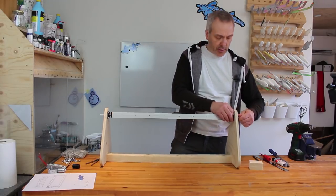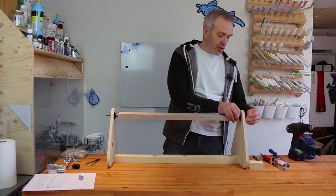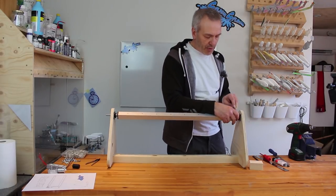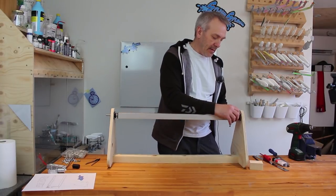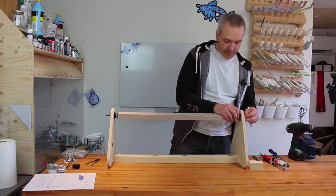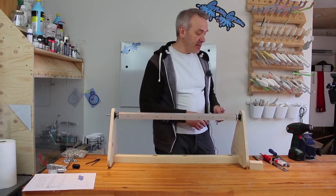Now I need to decide which end I'm going to use for the motor, and it doesn't really matter. I think I'll use this one. So this one over here, I'll screw in quite far, maybe like that. I don't want to use force because the threads of the plastic don't hold that much, I think. I'm not sure how much they'll actually hold, so I'll just keep that fairly lightly tightened. And here on the other end, I'll put another one. And this should make sure that the axis is locked in place there.